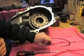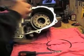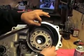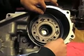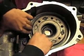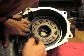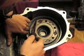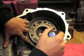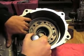Now we're going to put this thing in. This is a big snap ring. What you want to do is orientate it into a position where you have the most room to work. Get one side started — rotate it, get one side started, take a screwdriver, press it up in where it needs to be. Then you will go around — you may need two screwdrivers, or a buddy, or another set of hands. You're just going to work the snap ring in all the way around. Once it's seated all the way in, you'll hear a click and you're done.